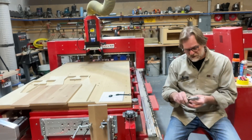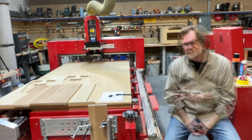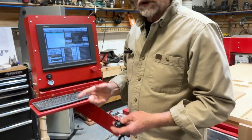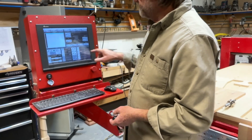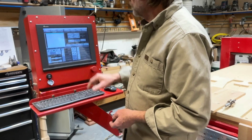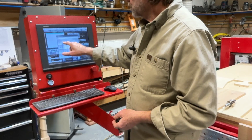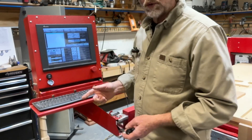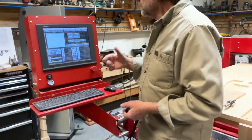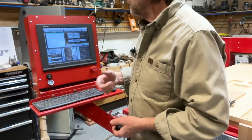So there's an introduction to this edge finder. I'll give you a link — I picked it up on Amazon. I'm going to set it up now. I've homed my machine, warmed up the spindle, and we're going to go to the vertical table. My X-axis Y fixed fence — that's the first offset. The reason I went to the screen first was just to go to the tool page. If I want to go here and type in tool 12 — of course tool 12 doesn't exist; I have only seven tools on my automatic tool changer — so the system already knows to come to the front of the machine to get the tool I give it.